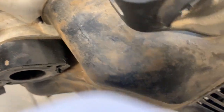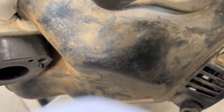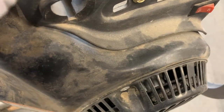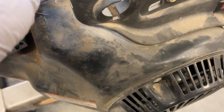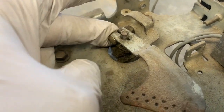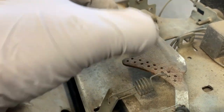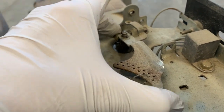Since I have a new spring, I'm just going to pry this guy off and out of there. This one may prove to be a little more difficult than I thought — I might have to bend this arm up to get it off. Or you can take the whole lever off by removing this guy and pulling it up, but it's keyed in very precisely and you have to put it back in the exact right orientation; otherwise the whole engine will not work correctly. So I'm going to try to avoid taking that off for the time being.